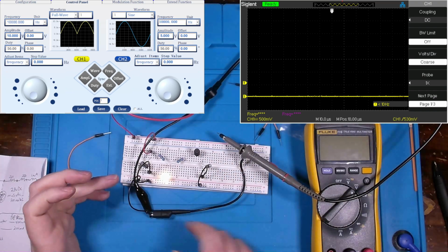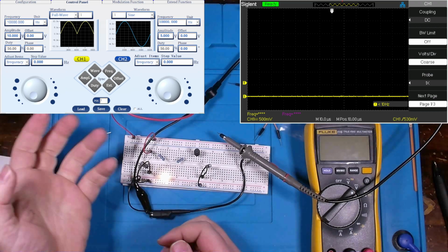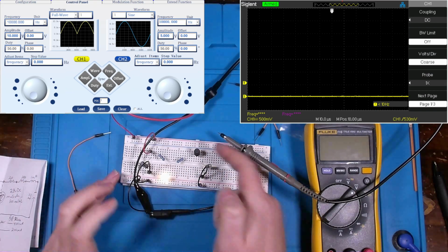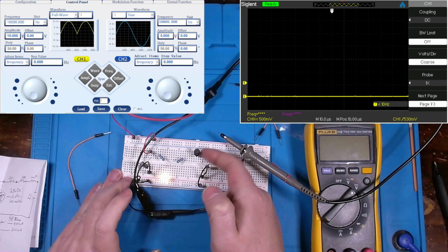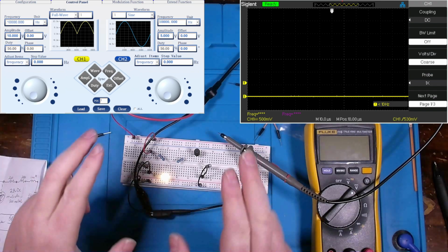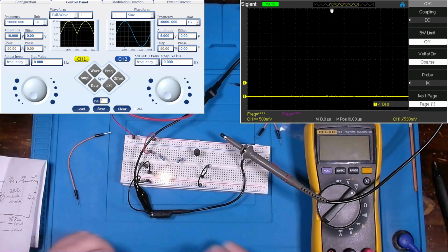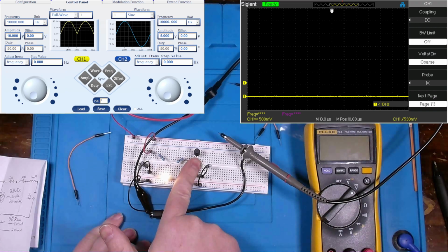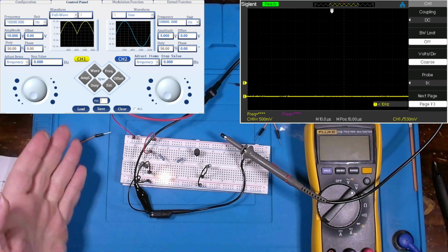Now, let's say that you have an electronic device and this is your LED, which tells that the power supply is on. You would also want whatever this supply is feeding, say if it was rectified 2.2, 2.8 volts DC, you would want the output of here to be extremely, extremely clean. So we're basically taking an unregulated DC, and well, I can't really say that we've regulated it more, but we've at least filtered out the AC portion of it to give us a super clean signal here, as well as a super better clean signal here to save the life of our LED to let us know that our power supply is on.